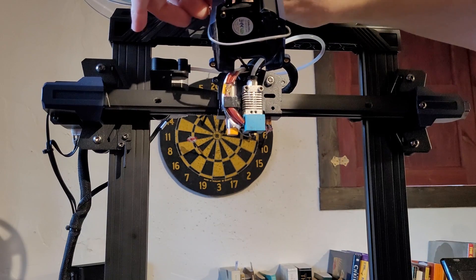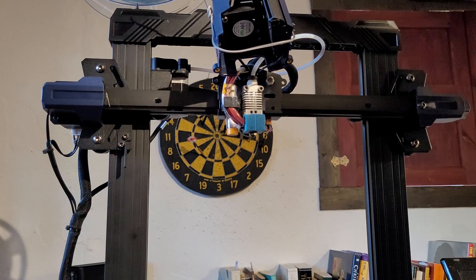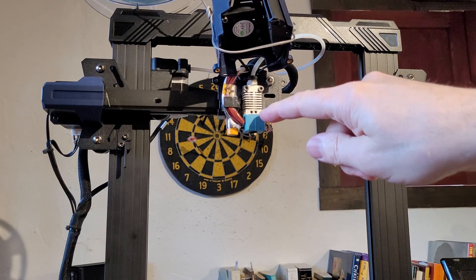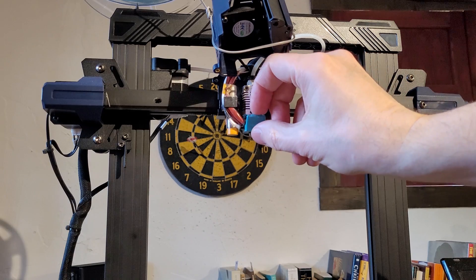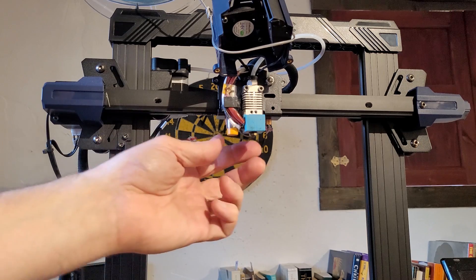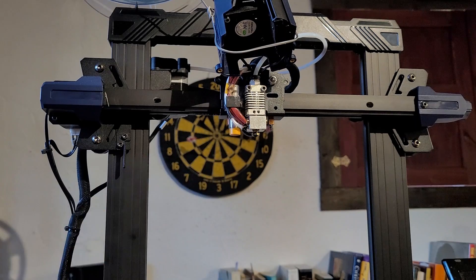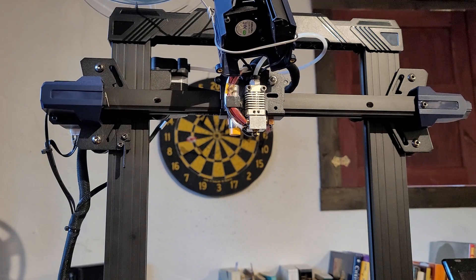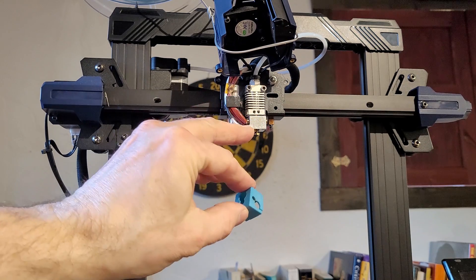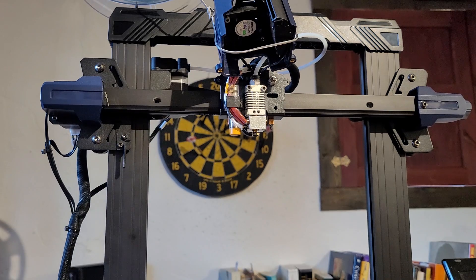I just don't want the cover to drop down while I'm heating things up. Now it's exposed. There's a little silicone sock under here — gently take that off, it has an opening. We don't want to tear it because we want to put it back. We need to grab hold of that block to remove the nozzle. It's intact, with a little opening to get around the wires, and it fits beautifully — I'll just set that down.